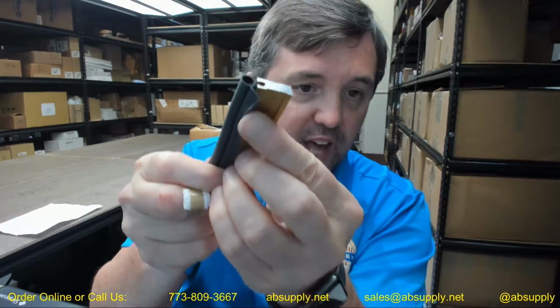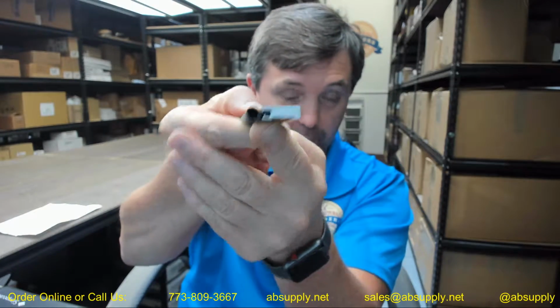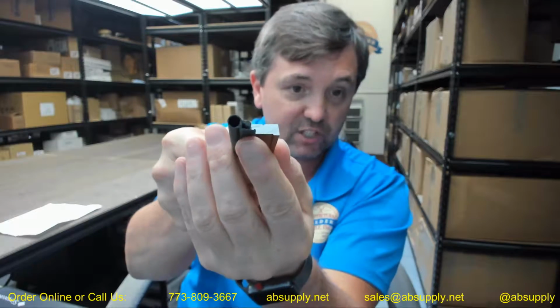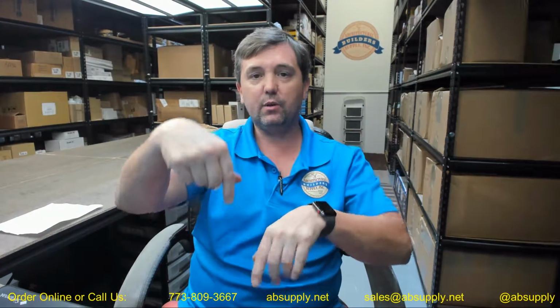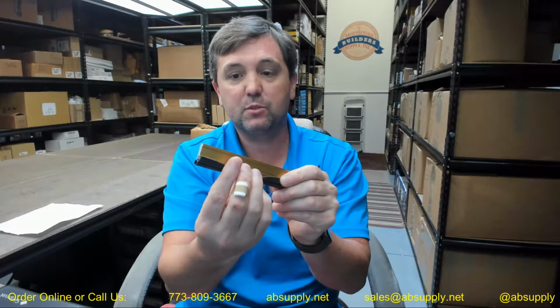One feature that I like about this 1842 is that it has this flap that goes back so that when you attach it down to whatever you're applying it to, you have the concept of a seal underneath. You'll see that sort of situation in a door sweep where you can see that material, discoloration has run down the face of the door. Well, it gets in behind when there's no seal inside. Well, this sort of stop strip with that flap that comes back will help prevent any sort of unintentional leakage underneath the material as well.